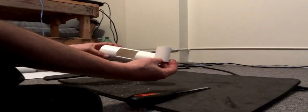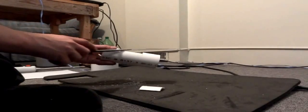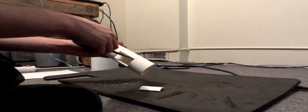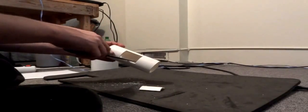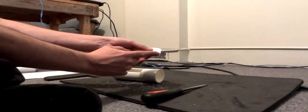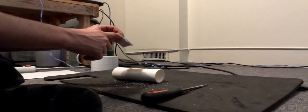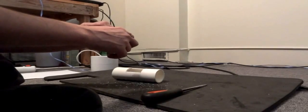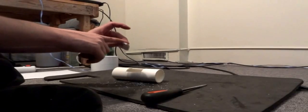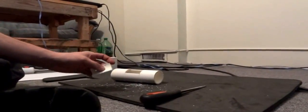This is the end result — this is going to be our valve. I'm going to put some sandpaper to the file, get rid of the rough edges, and make everything nice and smooth. Just because of the way it looks in the YouTube video I'm trying to replicate, I'm going to round off the corners so it looks a bit more fancy. I'll round off the top outside part of the valve using the belt sander because it's going to be a lot quicker.